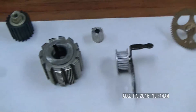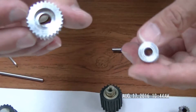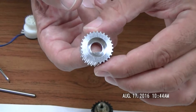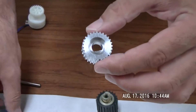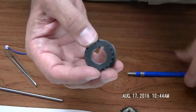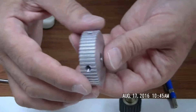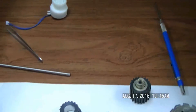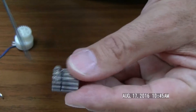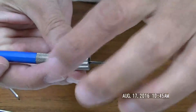We have other methods of fastening our gears to the shaft. Again, we have our set screw. You can also put a D in your shaft and a D in your gear, which makes a very good fit for high torque or tight accuracy. Another idea is a keyway: you put a keyway in your gear and the same reverse cut into your shaft, then put a key in the slot and everything locks together. In smaller gear applications, we put a cut into our gear and use the gear itself to clamp down on the shaft — tighten the screw and everything is locked as one piece.